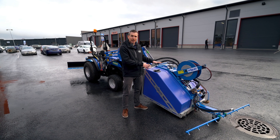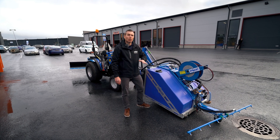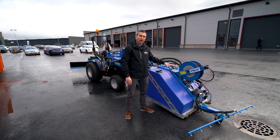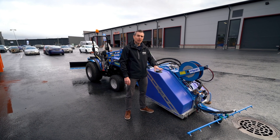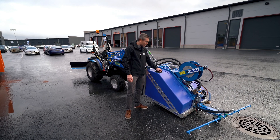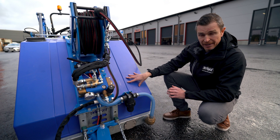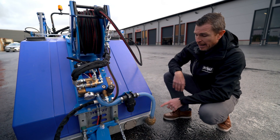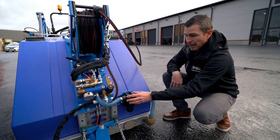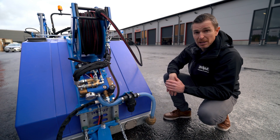This specific unit here is equipped with two separate but identical water tanks. Depending on the model, you will get from one to four tanks on your street washing unit. Refilling is very easy — it's done from the top through the opening which is here. The water connection between the tanks and the pump happens on the bottom, where you have a connector together with a suction hose and a filter to make sure that the quality of water going into the pump is as good as possible.